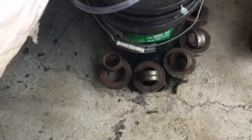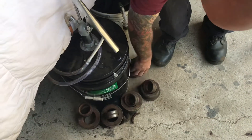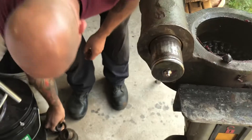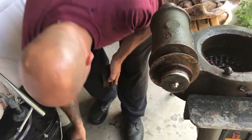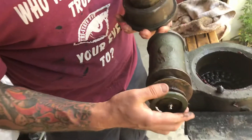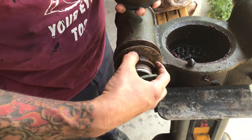These are the roller bearings that came out on the ends — got new ones coming from Oshkosh. Going to clean these all up and make new felt washers. Mike describes the assembly: it goes on with a copper thrust washer, then a felt washer, then the bearing gets pressed in and slides on. Then one of these retaining rings goes on, and then a large snap ring holds it in place. Be cautious with the snap rings because they're not very plentiful — they're hard to get.